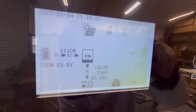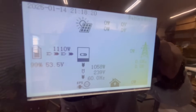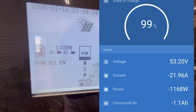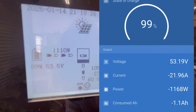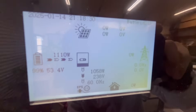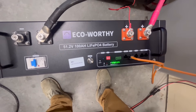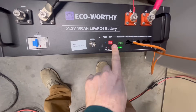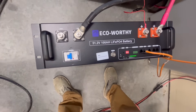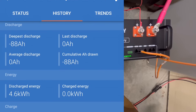Everything is up and running. I've got the battery discharging right at a 0.2 C rate. I've got a heater and a heat lamp on it, which I don't mind because I'm cold anyway. We'll check back in around five hours or so. The first capacity test ended up at 88 amp hours — so we were 12 amp hours shy of the stated capacity of the battery.